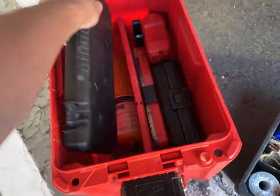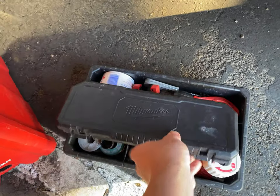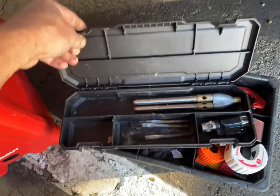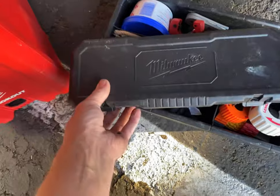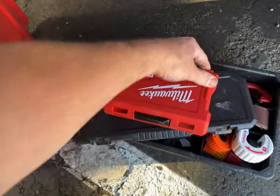Right here's a little piece that comes with another Packout toolbox, and I use this to keep my double barrel for my Goss torch. This double barrel is really good for sweating like an inch and a quarter, an inch and a half copper. I keep the flux brushes in there and an igniter because the double barrel doesn't have an igniter.